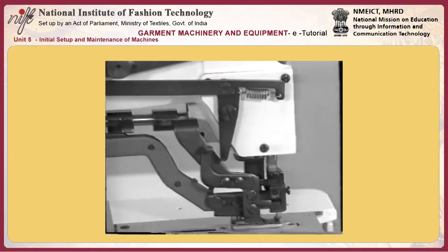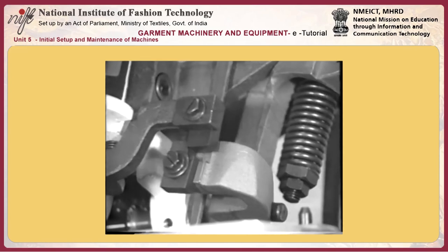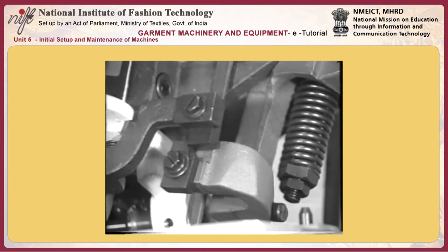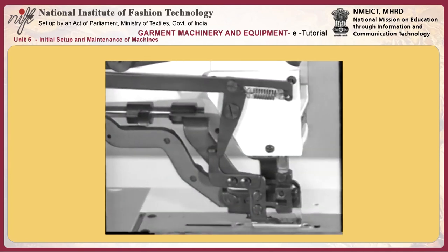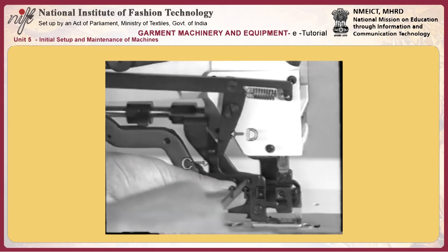The plunger pump not only lubricates the path, but also works as an oil return pump. Excess oil accumulating in the face plate is gathered through oil return felt F. The oil is sucked by the pump through oil return tube G. The sucked oil is then returned to the oil return tube C of the pump body.